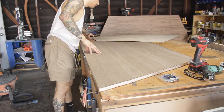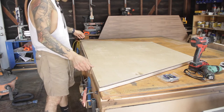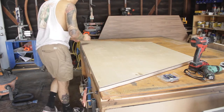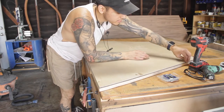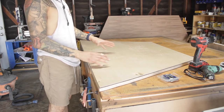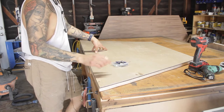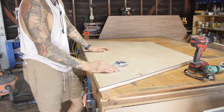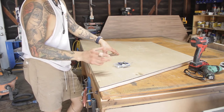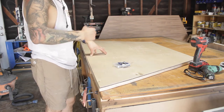I have the rough shape cut out now. I'm going to place my template right on top and use the flush trim bit on my router, and that should give us a nice perfect match to my template. Just making sure we have enough hanging over on all sides. Since I'll be laminating two pieces of plywood with the same shape to give it a thicker tabletop, I'm going to fasten some number six screws to the workpiece so I can use the side with holes on the laminated side.